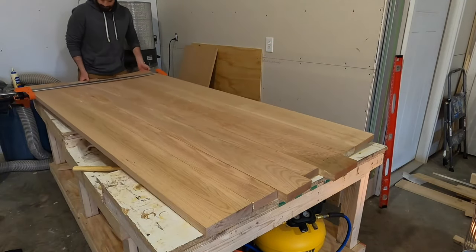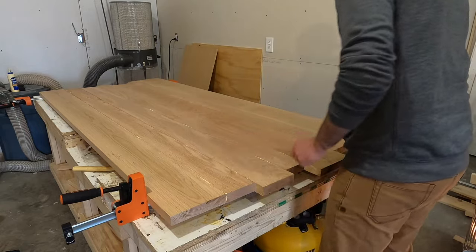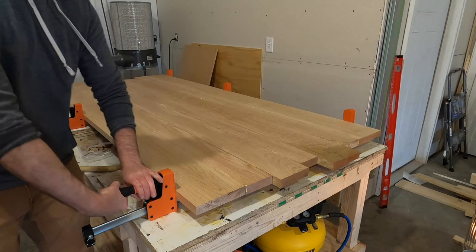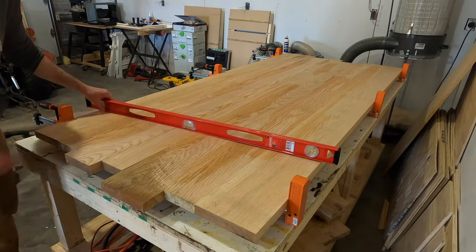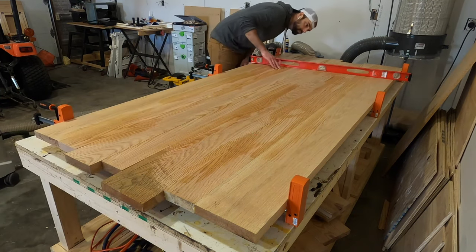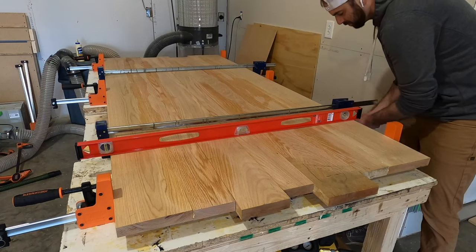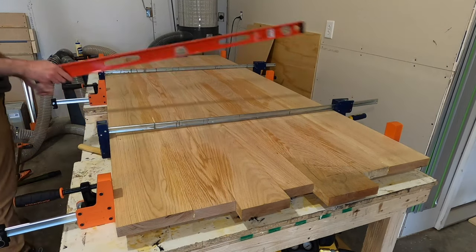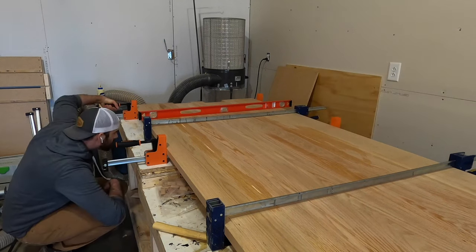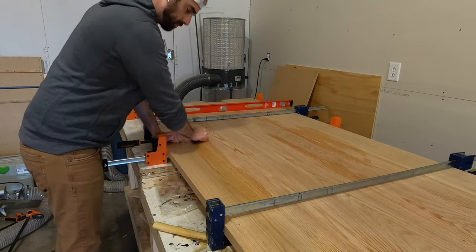Because this table was so big and the oak was so heavy I had to do the top in two pieces. Unfortunately my camera quit recording whenever I did that, but I made one side dominoed together, then I made the other side. I set both boards flat on the table top and then just pulled them together with clamps. I'm trying to use the level as a straight edge to see if there are any dips or bows or gaps in between the boards. By keeping an eye on the level you can finesse the table top right into shape just by slowly and barely turning the clamps on one side to influence a bow or a cup across the entire width of the table.